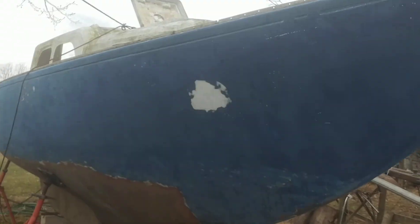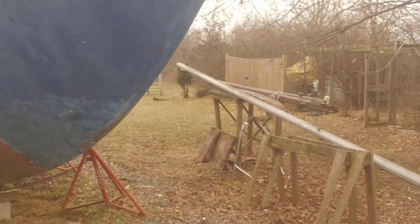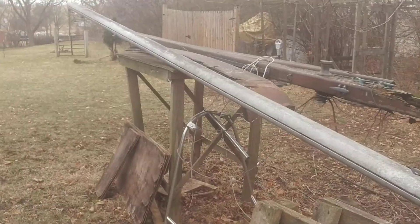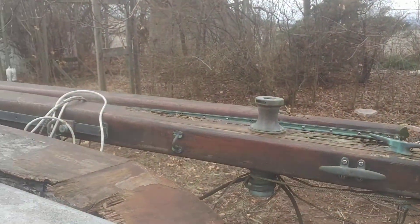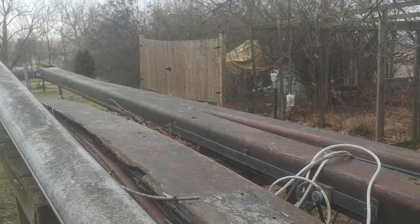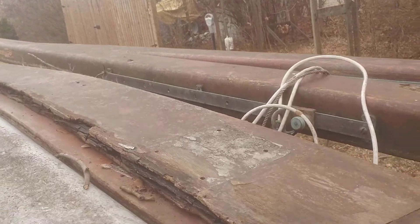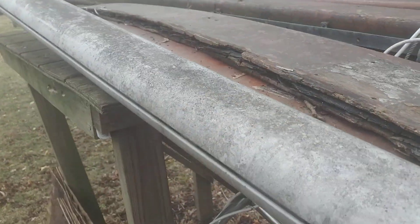There's an old repair of some kind that didn't go all the way through. Some of the parts I'm not going to be able to salvage. Picked up some Sitka spruce and milled it up, getting ready to start actually building a new mast. The old ones are pretty well shot as you can see — won't be reusing those, but did use them as a template.